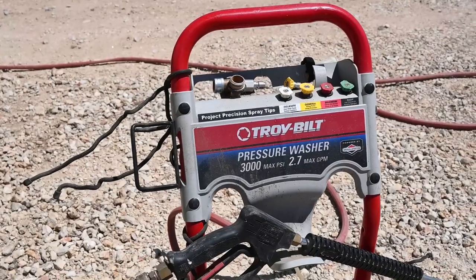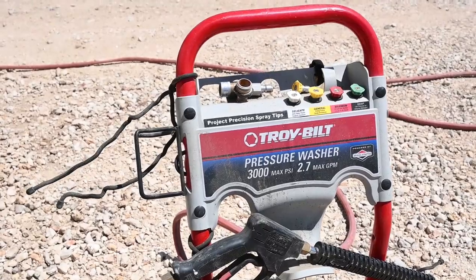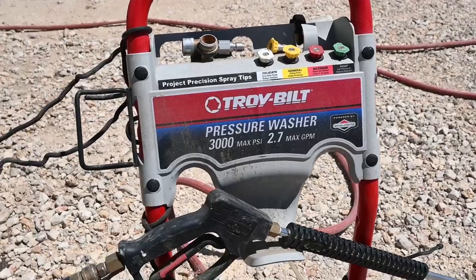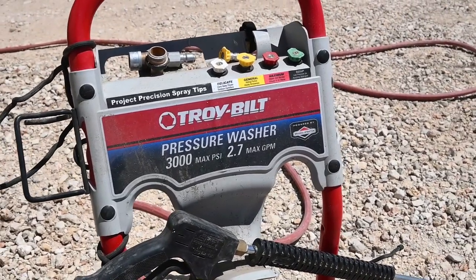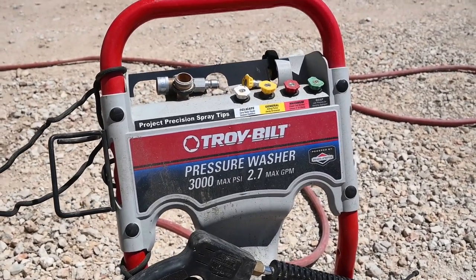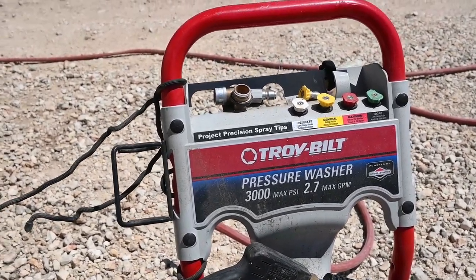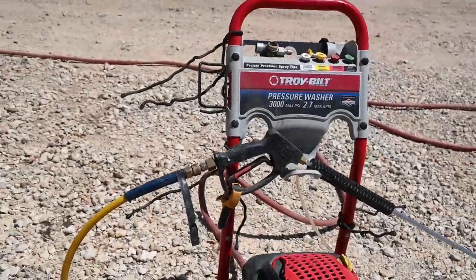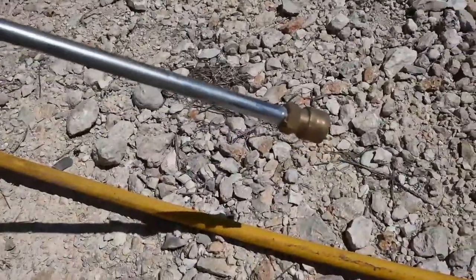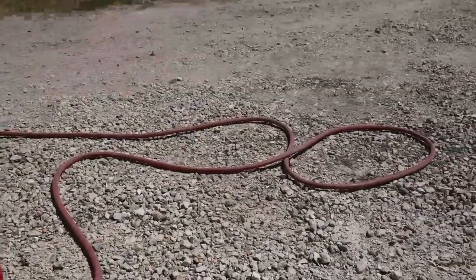Side note about the pressure washer: in the description or options on Amazon, it'll give you choices of what orifice size to use, and that's based on your pressure and flow rate. So this pressure washer is pretty basic, 3000 PSI, 2.7 gallons per minute, and it takes a 3.0, I believe, orifice on the website. So be sure and note the requirements of your pressure washer to make sure it's the right size orifice you buy. And like I said, mine on this wand does have a little quick connect release to utilize the attachment piece.